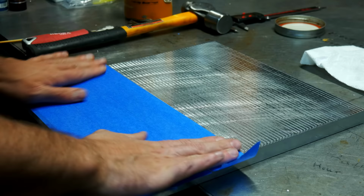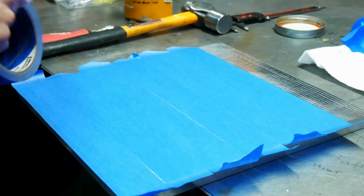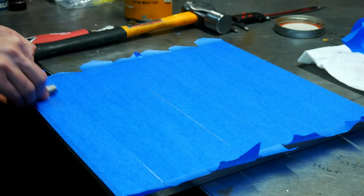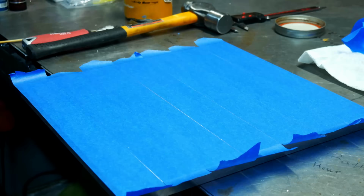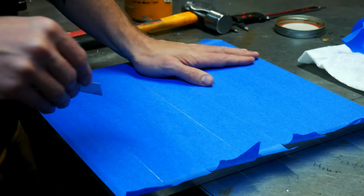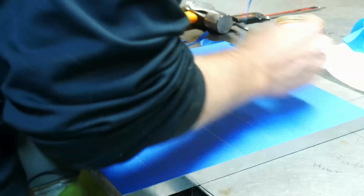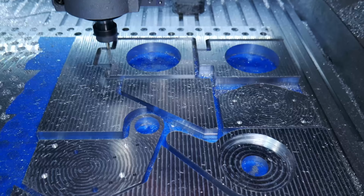It is kind of satisfying to watch this stuff go down. And then I always use a burnishing tool to make sure it's really stuck down, because you do want good work holding strength out of what you're doing. And this stuff really does hold on very tightly. I mean, you can machine on legit machines that are putting a lot of torque into your parts, and they'll hold on with this method if they have enough surface area. Can't do it on a really small part, but these things are really on there.